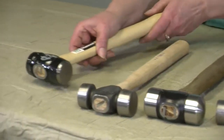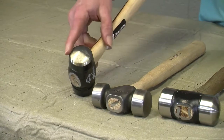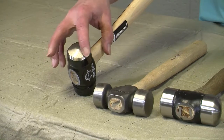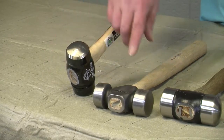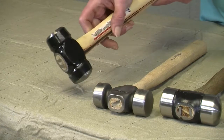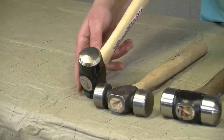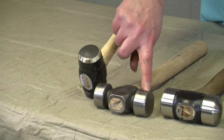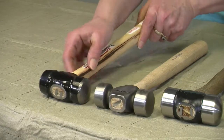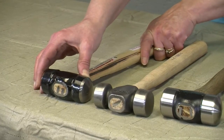The last one we have in line is the diamond rounding hammer. As you can see, the edges are still a little bit prominent but not as buffed out as the NC or the Nordic. The flat side is not as flat as the NC side, as you will see. Also the face is a little bit shorter. This is the one and a half pound hammer.